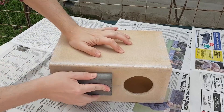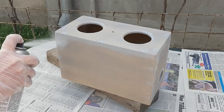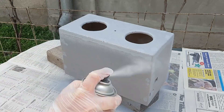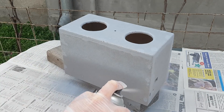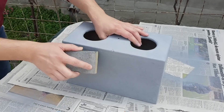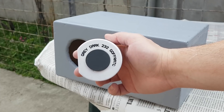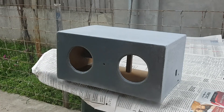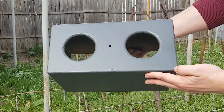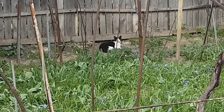I'll use 2-part adhesive to fix the bass reflex tube. To paint the speaker box, I'll take it outside — but first let's give it a final sanding and use a cloth to clean it. I'll spray a few coats of filler primer and try to fill some of the imperfections. Spray the primer or paint with horizontal linear moves and don't rush the process. After every coat of primer dries, use sandpaper to smooth out the surface. To paint the box, I'll use a dark gray spray can and give it 3 coats of paint. The speaker enclosure is finished — I should have used more wood filler on those screw heads, but nobody's perfect.